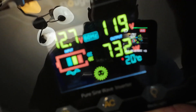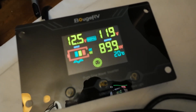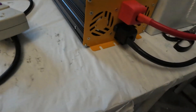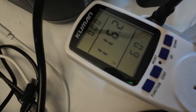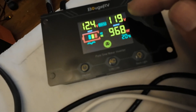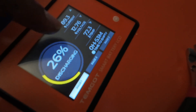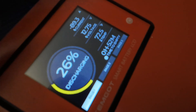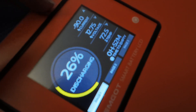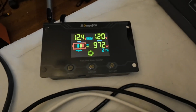The output is showing about 700 watts on setting one. On setting two we're at about 960 watts. The voltage has dropped to 116 volts on the watt meter, though the inverter display is still showing 120. Swinging over to check the battery, it says it's using 90 amps at 12.76 volts. So 12.76 times 90 is about 1148 watts — call it roughly 990 to 1080 accounting for the math — showing some efficiency loss, which is understandable. Let's take this up to the next level and go to setting three — that got us up to about 1300 watts.